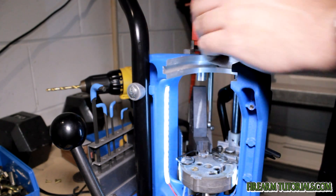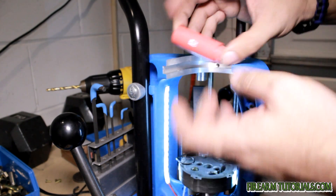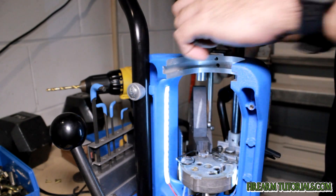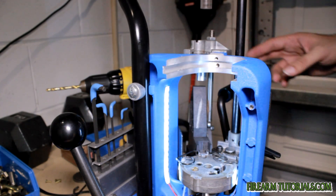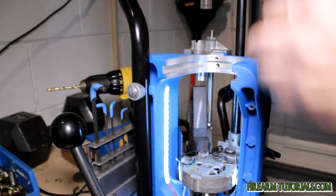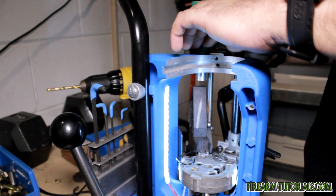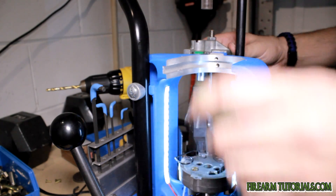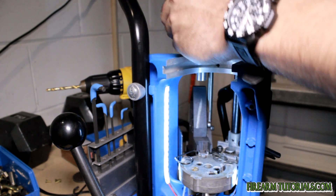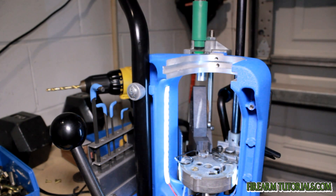Now I'm going to deal with this tube here — it just pulls right out. You've got two pieces: a long piece that goes directly to the tube, and a smaller piece that goes into the little arm which feeds the shells. Obviously both will need to be swapped out. They're color-coded — the 223 one is a white one. Put the small piece down in there first; it only fits one way. Then this piece has a little notch on it, so it only fits one way as well. Get your tube snugged up in there, and that's pretty much it for that part.